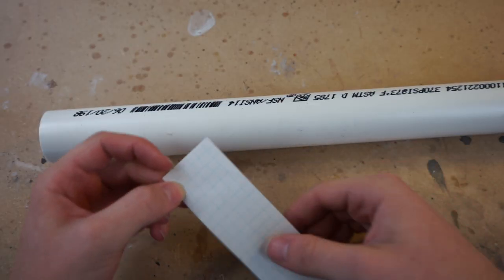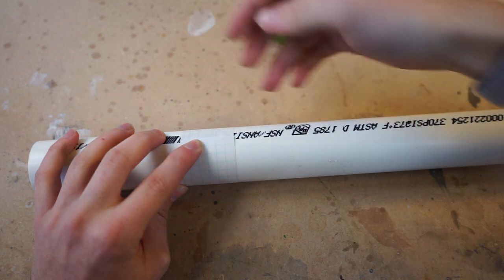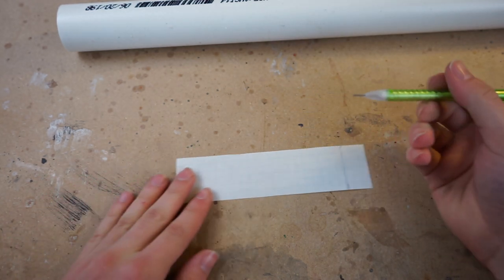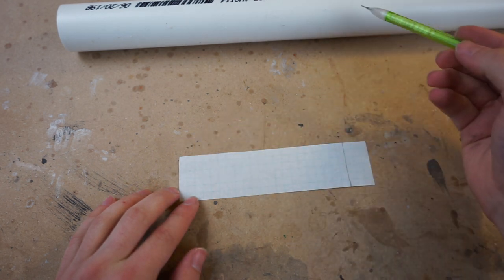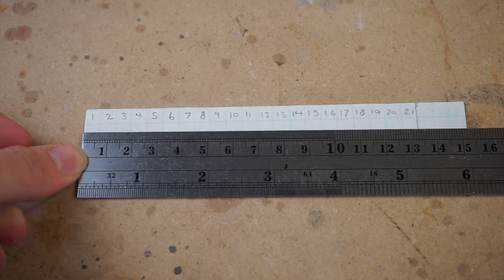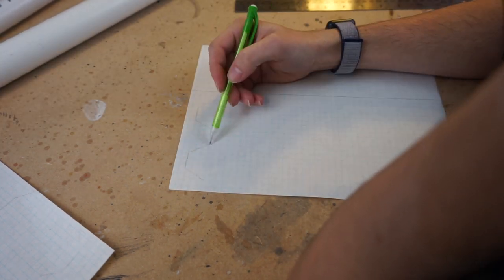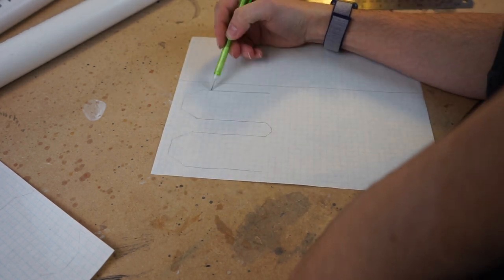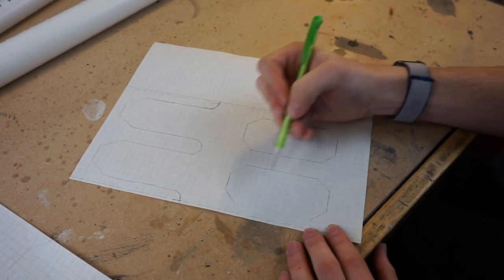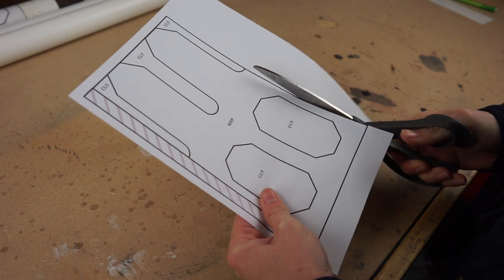I'm using this piece of graph paper to transfer the outside diameter of the larger pipe onto a flat surface so it's easier for me to make the pattern later. Now using that measurement, I can start to draw my pattern. So I ended up drawing mine out on the computer, and I'll leave a link in the description to where you can find this if you want to build one yourself.